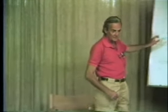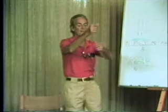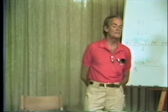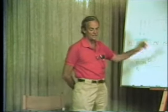Well, by taking different waves, yes, oh yes, indeed. But different waves are not called light. We call them ultraviolet light, or X-rays, for instance. X-rays are, in fact, exactly that. They're light, but with a shorter wavelength than normal light. Now, in principle, you could do, and people are trying to do, this kind of thing in which the X-rays affect the resist. You're absolutely right. They have to go through another technique. The photographic technique for making the pictures can't be silver and so forth, but you do it a different way. And there's a lot of work. X-rays is, in fact, one way that is being worked on in various laboratories to reduce the size of this. Yes, that's a good idea.